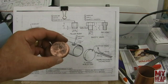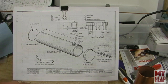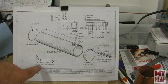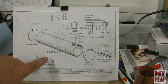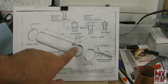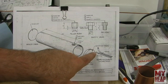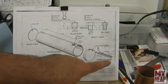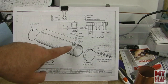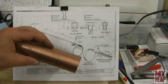Both boiler end pieces are made. Of course I need to turn them down a little so they're a proper fit in the boiler tube. Looking at the drawing, there's an exhaust pipe that we'll anneal and bend to shape, probably not until it's put into the block. There are two holes: an eighth-inch hole in the end of one for the supply tube, and a hole up top drilled number ten — I'm thinking three-eighths. I'll find the closest size and drill that, then mark and drill the tube.